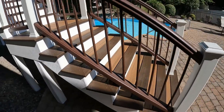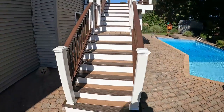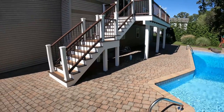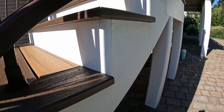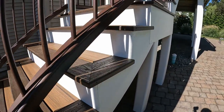These came out really nice as well, gives this deck a really nice look. White posts and then all the pressure treated got wrapped with white PVC, so it looks really great. We used white quarter round on all the corners here to make the corners smooth rather than having square edges on both pieces of your PVC.